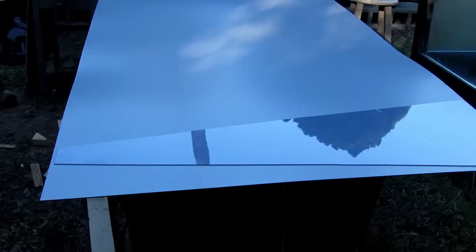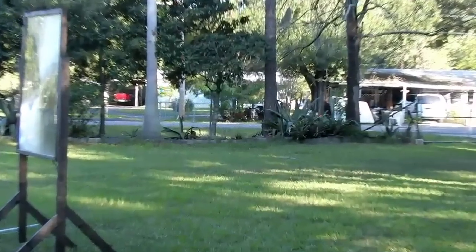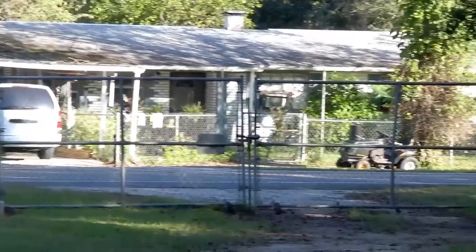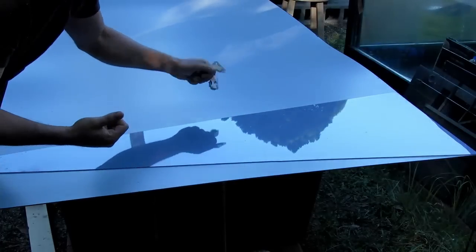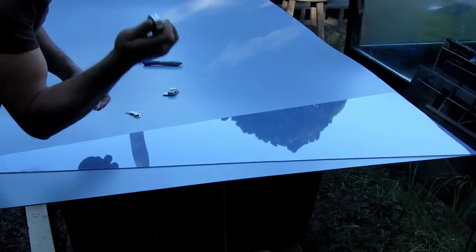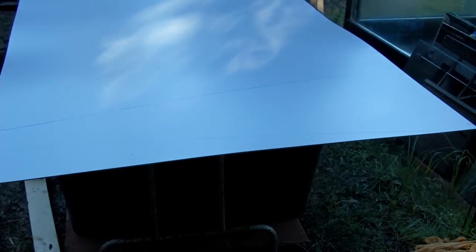Try to do this when you're not out in the sun because the sun can actually heat up the gray part and damage it. To shape the clear acrylic guide, you use the same cutting technique for the acrylic mirror that I show later in this video. I use neodymium magnets to hold the guide in place when I mark it with the marker, that way it doesn't slide around. It's important to note that the lines from base to peak on the guide are not perfectly straight — they're a little bit egg-shaped and bow out in the center. This shape is what allows it to fit nicely into the dish.